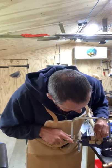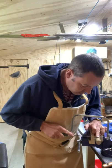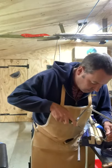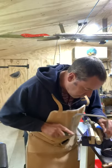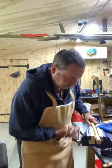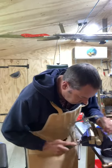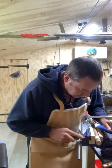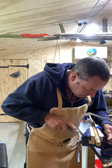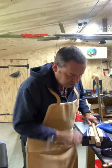Now I want to see how deep I'm going - I'm just about a blade deep on this. This is useful because it does measure your depth as well. I want to get down so that the saw has just disappeared. I'm going to turn it round a little bit and do a bit more. Always work on the top where you can see - don't work round the sides or underneath because you will make mistakes. Just keep following that line, a bit at a time, keep checking your depth. Now I can see the other line coming underneath here - it went right the way round, and this next one will join them up.